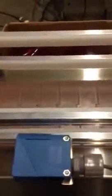This is your photo eye. You want to preload with containers in here before you start your run in the beginning of the day. Once the photo eye is set up, you want to have a preload of 4 or 5 containers. If it doesn't see a bottle, it stops filling up there. If it sees a bottle, it starts filling. But we preload them with 5 containers or so. That's your photo eye. That's what sees the containers and starts the initiation process. You asked about a photo eye. That would get tied into where this photo eye is already tied into.